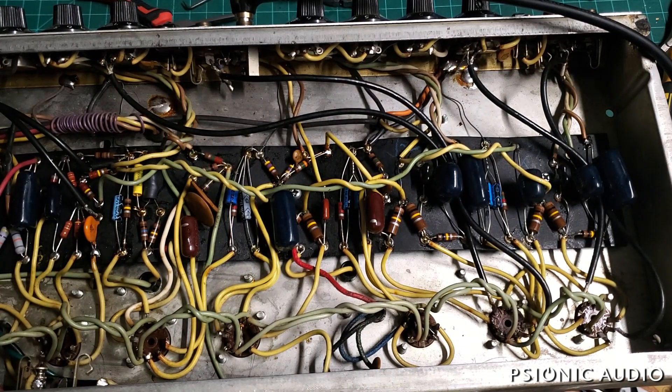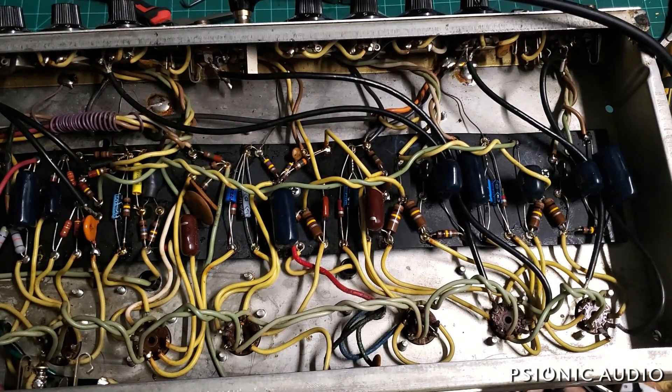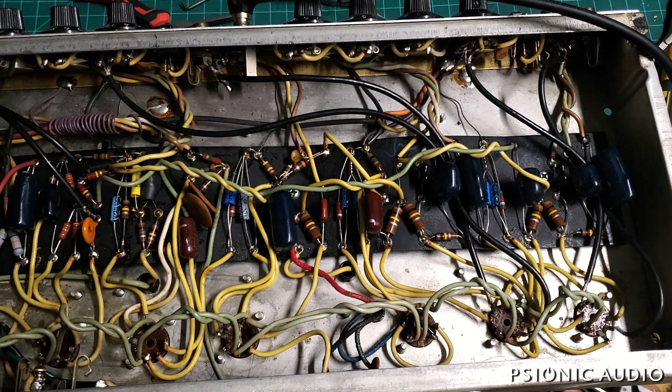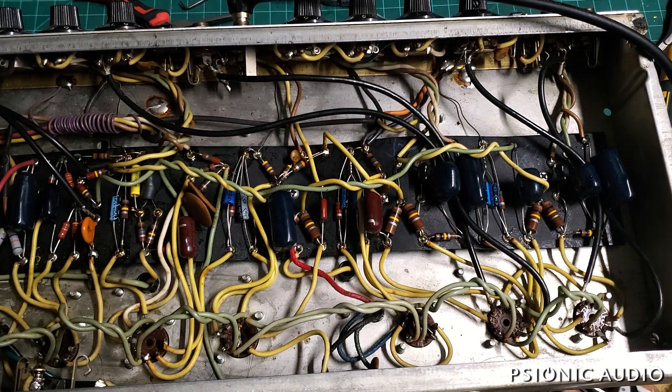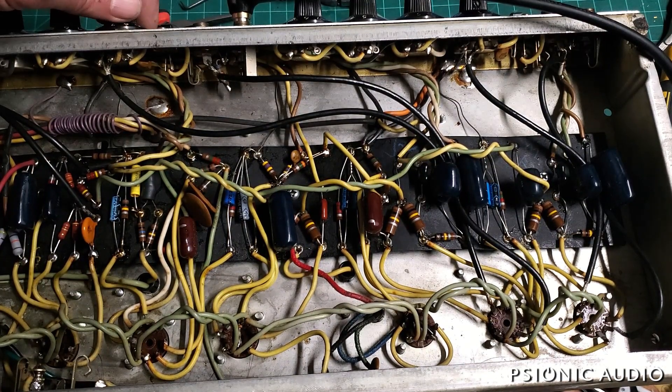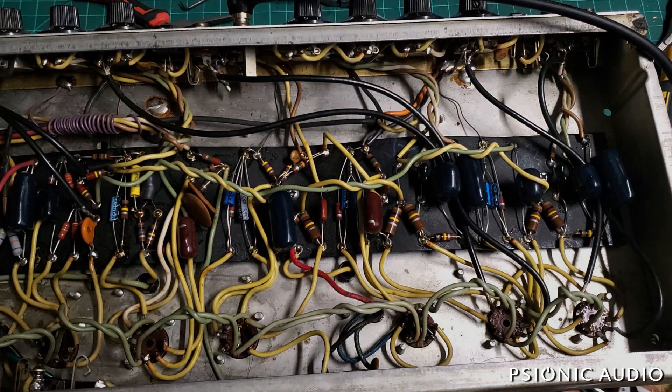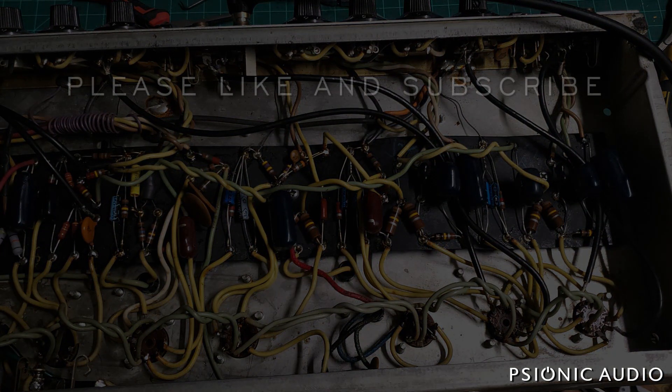Much, much cleaning later — all the DC is gone from all those nodes, and you can see the board looks a lot cleaner. It was one of those things where the board looked okay until I started to clean it, and the entire thing just had a film of old flux and dirt and sludge — a scummy conductive path. It was on both boards, and I got it all out of the way. The amp sounds a lot better now; there's no more scratchiness on the volumes or on the tone circuit. The amp is sounding pretty good, so I think the owner will be very happy. And after watching all the Beatles stuff the past two nights, I'll try not to play the same four songs for six hours like they did.